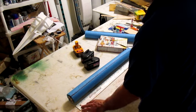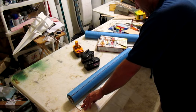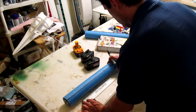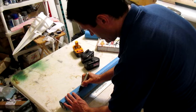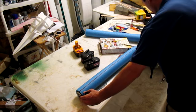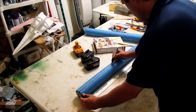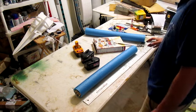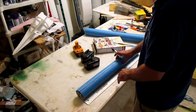So let's round it up to 30 inches. One third of 30 is 10. Let's cut that back a little bit. Let's say 9 inches. So our wing chord for this airplane is going to be 9 inches. So if we've got a 28-inch fuselage, the wings start at the 5-inch mark and end at the 14-inch mark. You understand? That's where the wing is going to be, and that's the wing chord. Now the overall wingspan will be 34 inches. That's important.